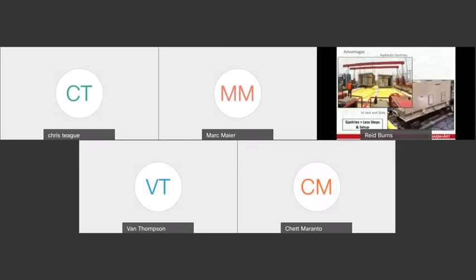Now, I'll admit, gantry arrangements do require shimming and cribbing of the track, but oftentimes it's minimal. And the advantage that you have is that you can go nearly immediately from lifting a load to then traveling it down in the direction that you need to go. So much more fluid motion, and they're advantageous when you need to set pieces down onto things like foundations or anchor bolts, because anything that's floating is oftentimes easier to set than if you're trying to lower it precisely down onto anchor bolts.